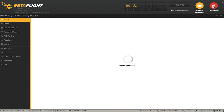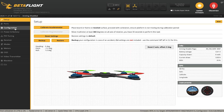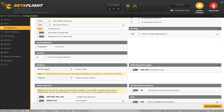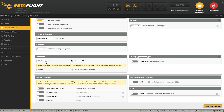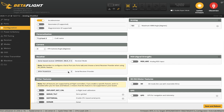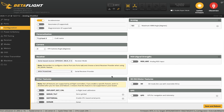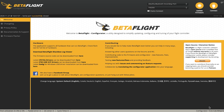Reconnect one more time and go into the Configuration tab. When you scroll down to the Receiver section, it currently says SPI RX — change that to Serial Based Receiver. Then change Spectrum 1024 to Spectrum 2048, and hit Save and Reboot.